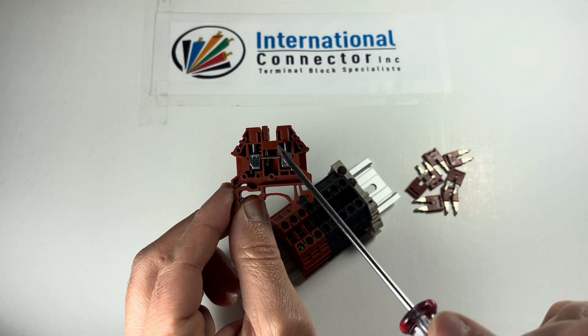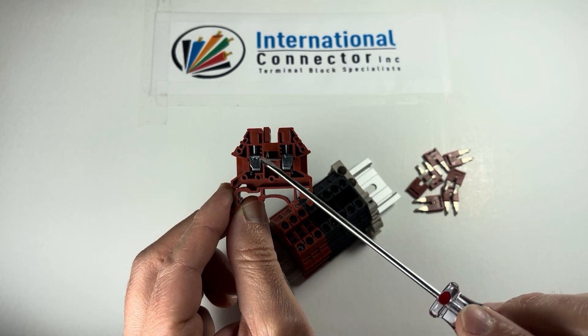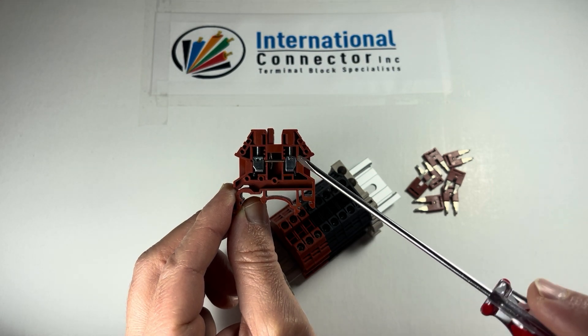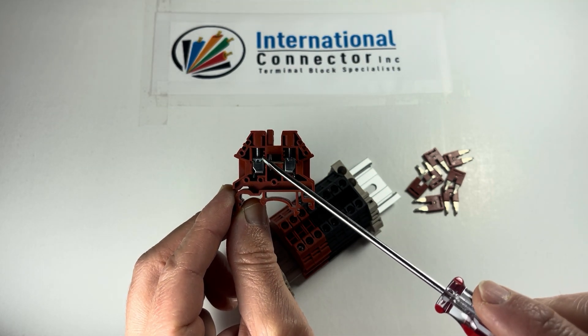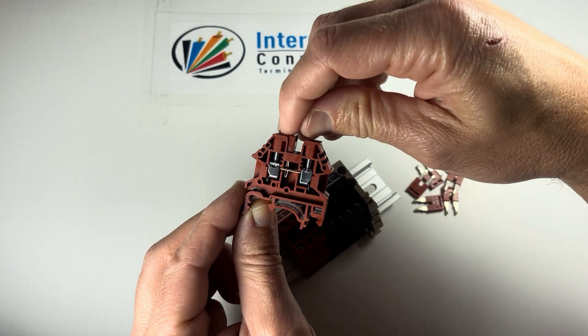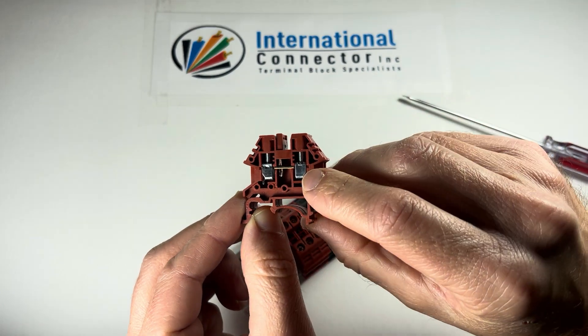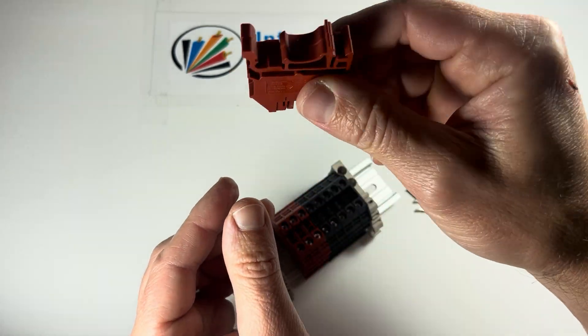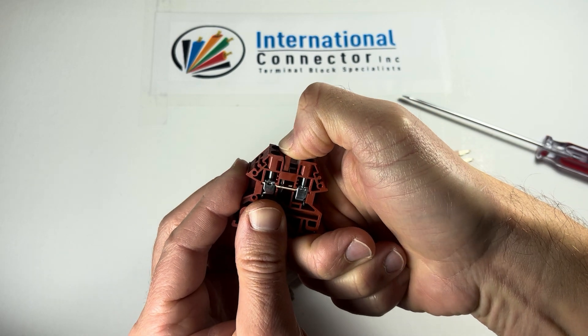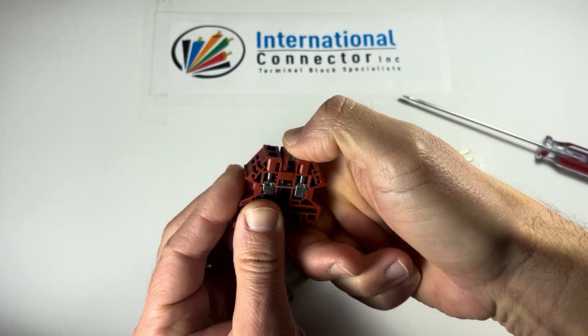It has to push down until it's almost flush, and then it goes right through this bar right here. There's a hole on either side, and this is a copper alloy bar that connects one elevator cage wire connection to the other one. Once that's in there, you have to use a screwdriver to pry it out — you won't even be able to get it out with your fingers, let alone have an intermittent connection or shake it out. So please make sure you're pushing these down until you feel them click.